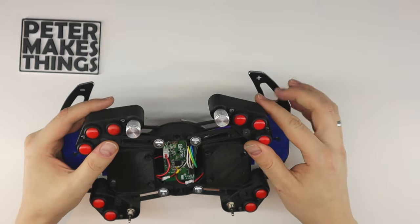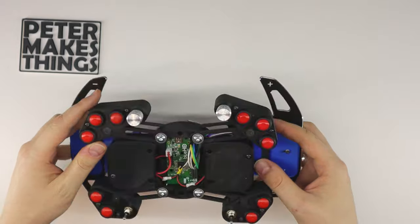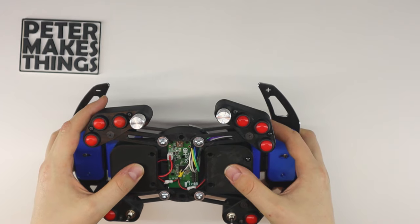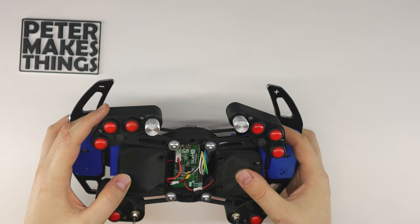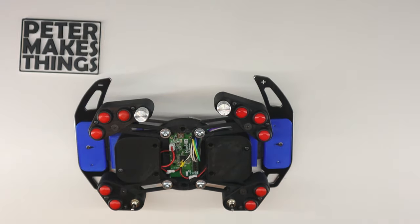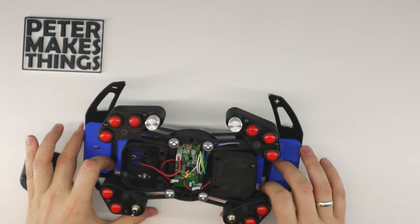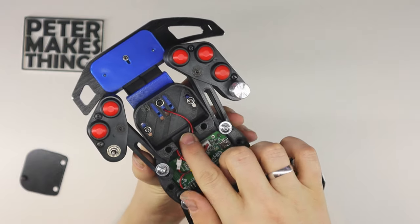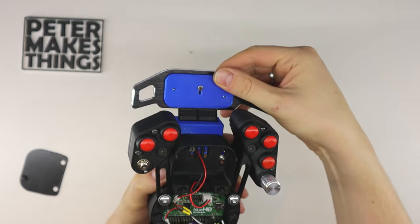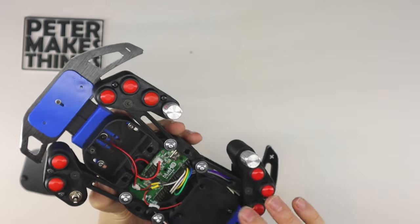The buttons and the rails are nice and tight right now, but while I have the wheel removed I can also take off these side covers here to gain access to the paddle shifters and adjust them if I need to. Inside you can see the holes and the rails, so right now I can just loosen these three screws and move the paddle shifter a bit, but this setup is okay for me so I'll just keep it the way it is.